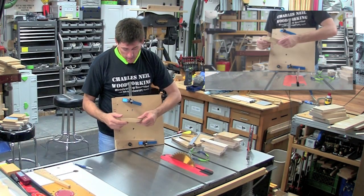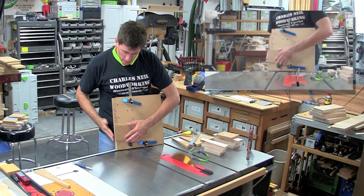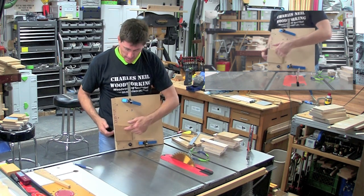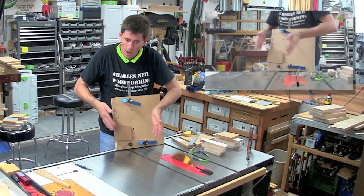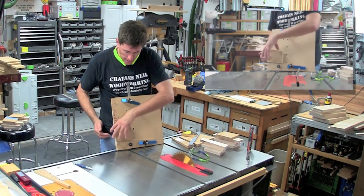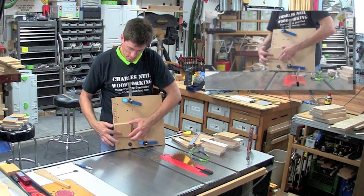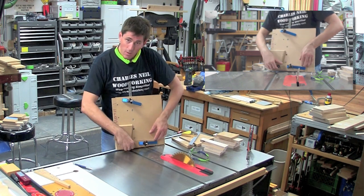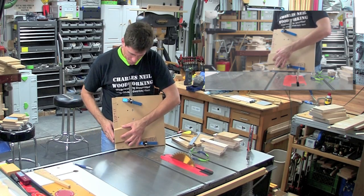I've already done the cut this way in order to make the bevel. So just like we did when we did the rip cuts, I need to now put it face down to make the other one so that we get parallel bevels on the top and the bottom, so that it's got flat surfaces when it's inclined. So I need to rotate this. Now, fortunately, it's the same triangle, except we need to flip it. Now things line up just fine.